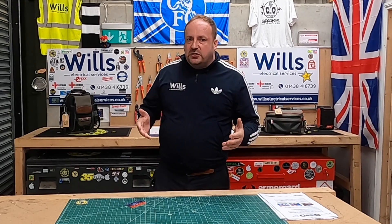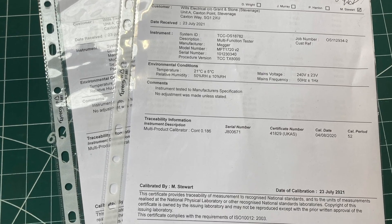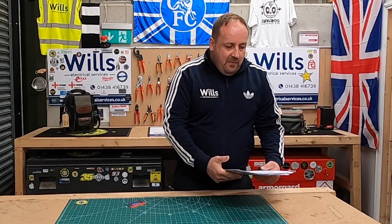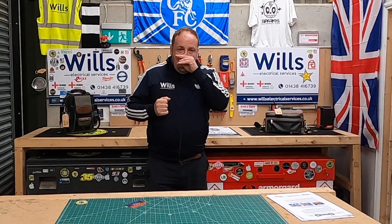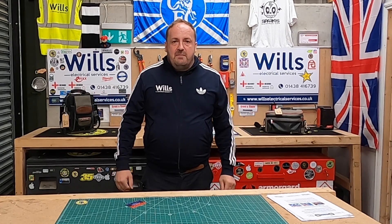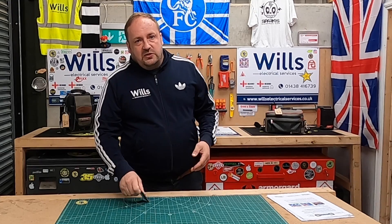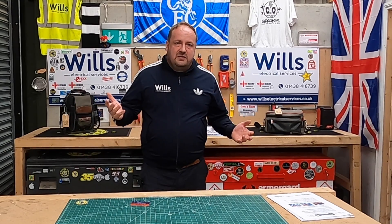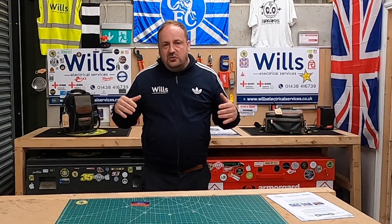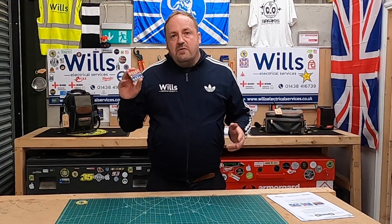What a cal card is, is a card you can use to check the calibration of your test meters. I've got two at the moment and I've literally just had them recalibrated. I got the dreaded call from the NIC that I've got to have my yearly visit. I can only really talk for the NIC because I'm an approved contractor, but I'm 100% sure NAPIT, Stroma, and Elecsa are all the same — you've got to have a record of all your calibration. With this cal card you can do continuity and insulation resistance; it's a series of resistors where you go between common and the different terminals.